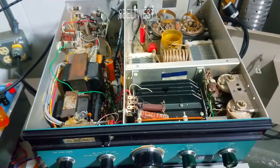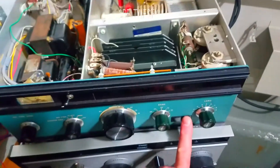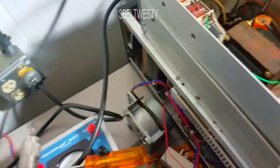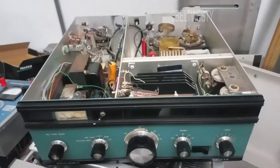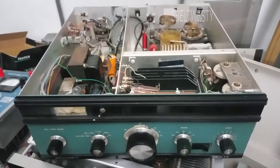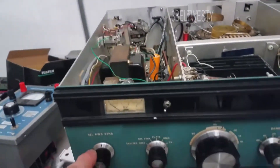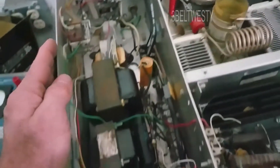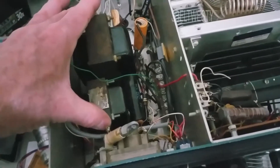I've got this tetrode SB230 plugged in - unknown unit, but it turned on. I've got it connected up to the relay jack with just a PL259. I'm going to go through here and short this out. This is a weird Heathkit SB230 that doesn't work. It normally uses an 8873, and what this particular thing has - all the power is on and turned on - there's no high voltage power supply in here. This is basically a bias supply for a tetrode instead of a triode.